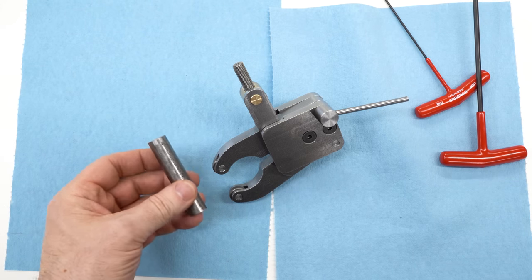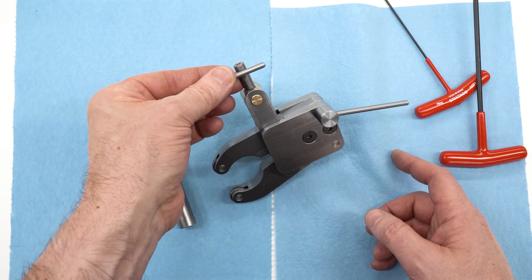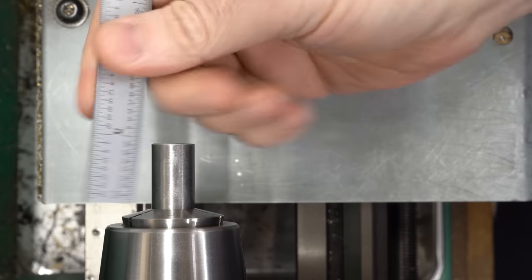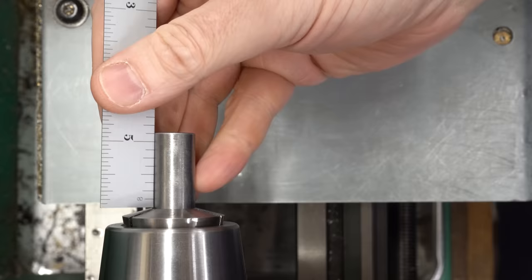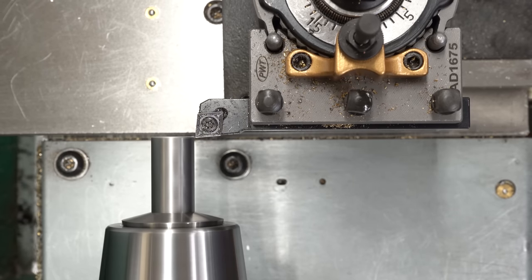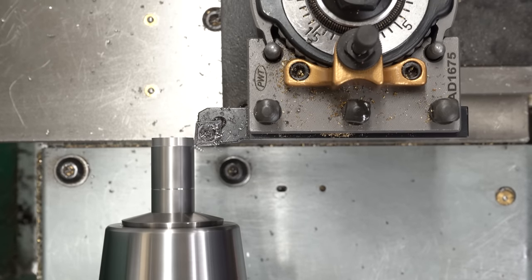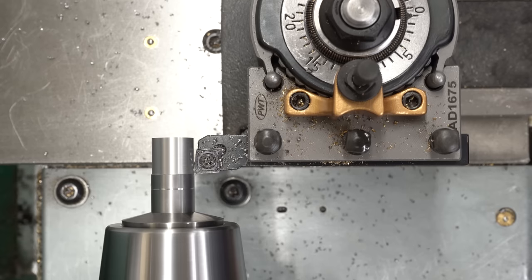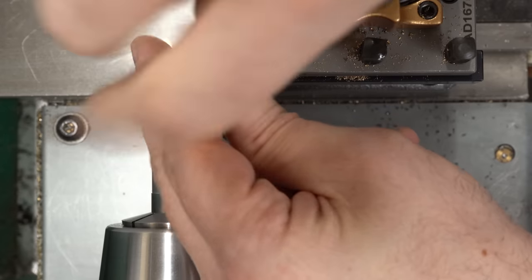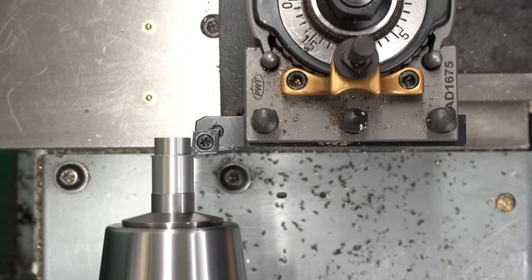We have one piece of stock left - to make the cap for the screw and the knob for the arm, and then the tommy bar pins the cap on the screw. These parts need to be knurled, but now we have a knurling tool so let's go to the lathe and get them made. We'll start with the knob for the end of the eccentric lever handle - just make sure I have enough material sticking out of the chuck and start by facing off the end of the stock. Then put a mark on the stock so we know how far down to turn it and start turning it down to diameter. I'm not liking the surface finish I'm seeing - I think maybe the insert chipped or is dull. After indexing the insert around and blowing out the pocket to make sure there are no chips caught under the cutter, that does look quite a bit better.